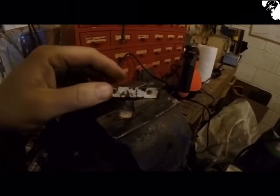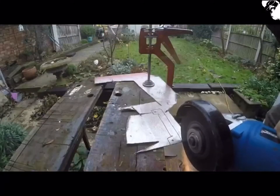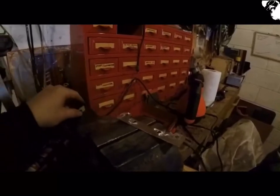Next on the list is this small bracket that's had its corner piece snapped off where it's so brittle. I'm sure I tried to make this before but must have just given up. It sits in front of one of the fuel tank braces that comes over and holds the wall up that hides it all. I've flattened out that bracket, traced round it on a piece of metal, and on the old bracket the screw holes are actually dimpled in — dished in on the rear. I've been able to recreate that on the new one simply by putting a suitable size socket in the vice and using a punch to drive through the holes.